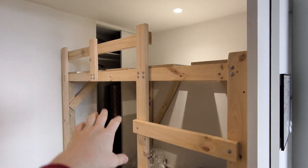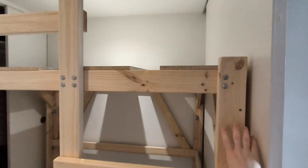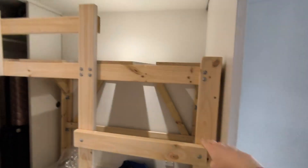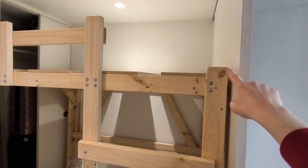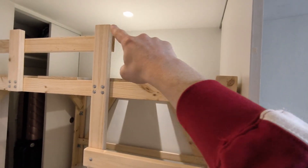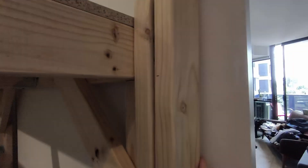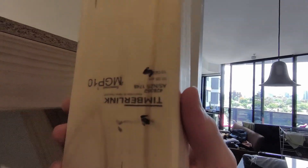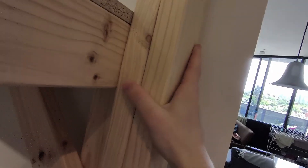Even though the bed is mainly done, I had a bit of an oversight — I want to add a piece of wood here, bolt it in, and match it to the same height so you have two things to grab. To make clearance for the two bolts, I put some pencil on the board, held it up, gave it a whack to transfer the hole positions, then drilled them out using Forstner bits. Now when I put it in place, it's flush.